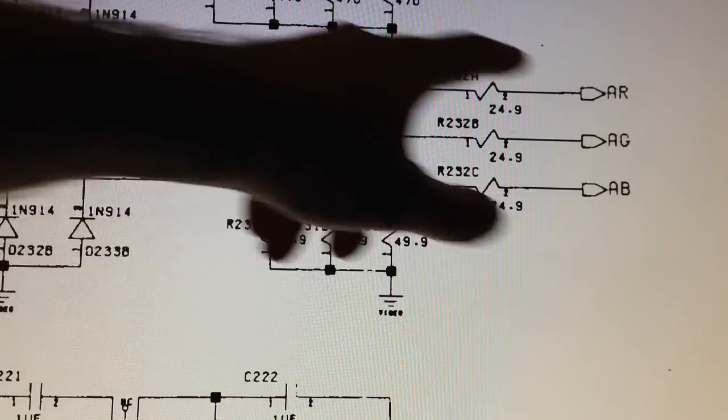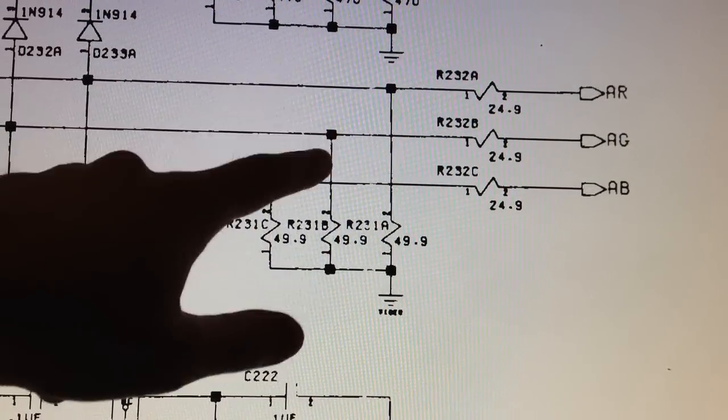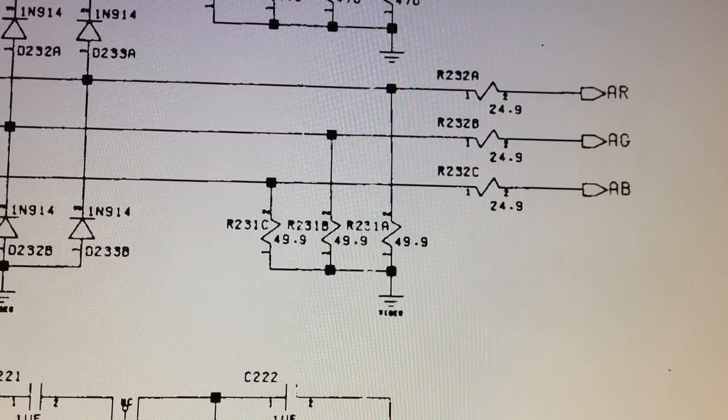Okay, so now when these resistors are back in place, right where they should be, we could definitely see an improvement in how the colors are showing up on screen. So, we're making progress here. Great. Now it's time to take a look at the other problem, which would be the blue color suddenly changing in intensity as we are crossing the midsection of that slide bar in ProTracker.